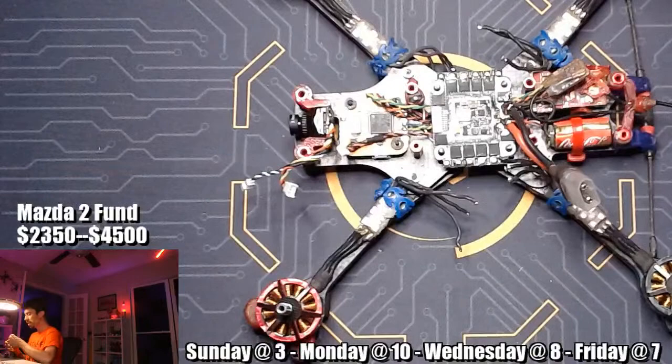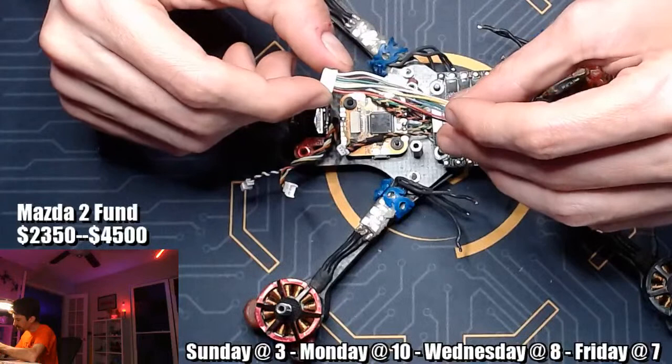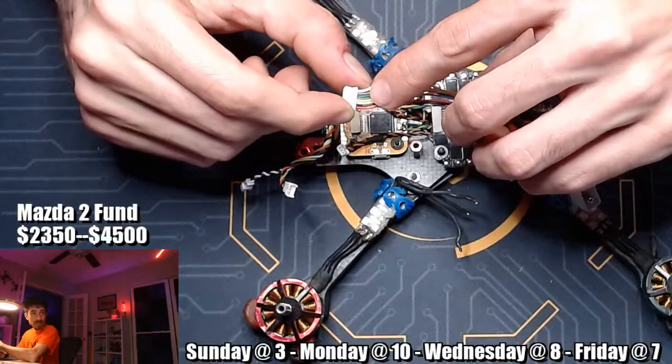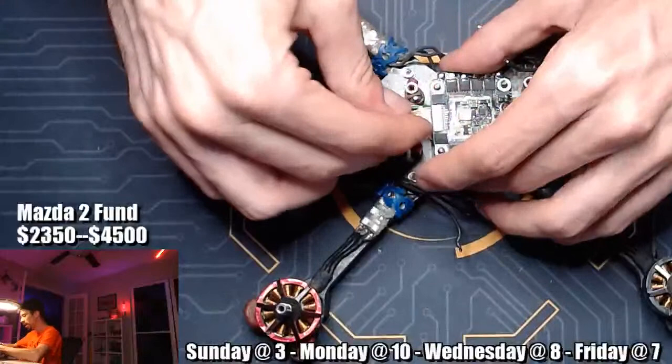Pyrodrone, great work. So now we just want to double check. We've got pins up, positive, negative, negative, positive, good. And then we've got motors 4, 3, 2, 1. And then we've got yellow and pink. Pink is TX. And then pink on here is next to ground, and that's marked RX, good to go. And then current is yellow. And then we've got current. Yep, so we are all set.